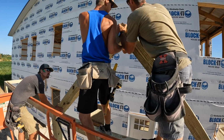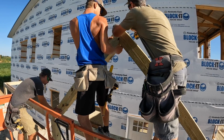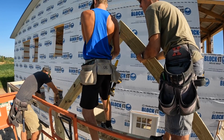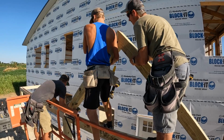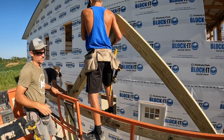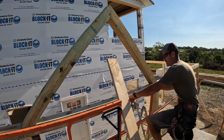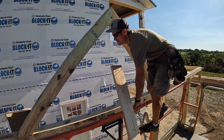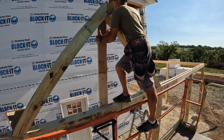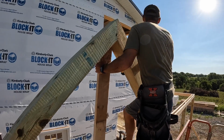Okay. So actually pretty good. All right, now Jake, push yours in a little. Do I need to start a screw? Yeah, just start a screw. Now put one there and there. I'm just gonna put some temporary bracing up here so this doesn't get knocked over by accident. I mean, you can use 2x4s unless you can get two out of a 2x6. You should be able to. As long as you can get two, you can use 2x6, otherwise just use 2x4.